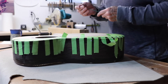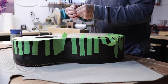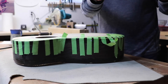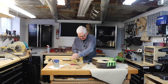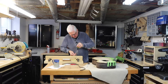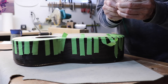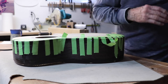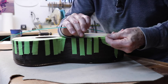What I want to show you is one of the things I have already done on the purfling, which is what this is here, already set up there. You can see it's cut on an angle. All I do is cut that on an angle because it's less likely you're going to see it. I just take the chisel, put it on an angle — it doesn't even matter the angle so much — cut it, and when I take these two pieces and turn them over and put them together, they fit perfectly and you can't see the seam.